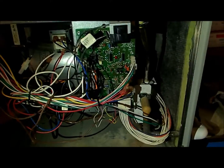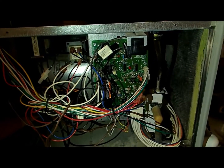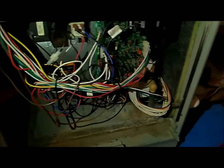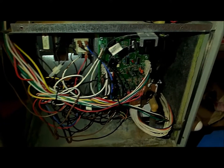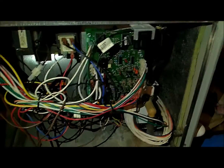The Carrier motors, if you buy a new one, can go over a thousand bucks. For the Trane they seem to be a little cheaper but still around five hundred bucks. If it's the same problem, it's a three dollar part you can get online — and the part is a thermistor. A thermistor is basically a variable resistance: the resistance increases as the temperature of the component increases. So when there's too much current, the thermistor temperature starts to increase and it increases the resistance, basically preventing an overcurrent. So it's a three dollar part instead of six hundred or over a thousand dollars.